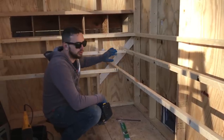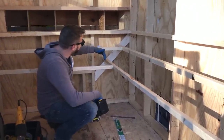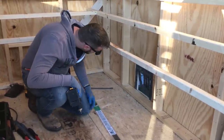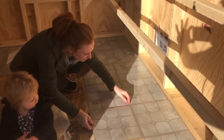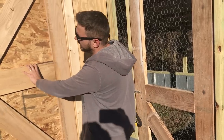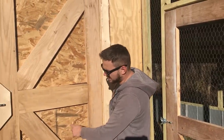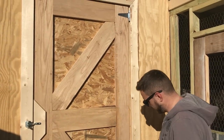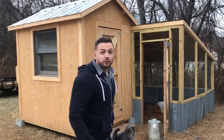Roosting poles here, just about 10 inches apart. There's plastic that you can buy from Home Depot that you put underneath of your hot water heater — I cut it into strips and put it down there to kind of keep things ready inside. Putting in some peel-and-stick tile. I'm using some old two by six, some one inch ash that I had from a flooring project a while back, and threw some plywood on the back. I just mounted them and picked up some shed hinges from Home Depot and trimmed it out.